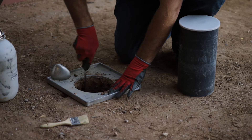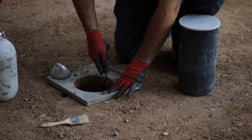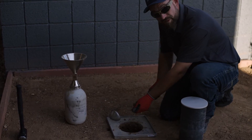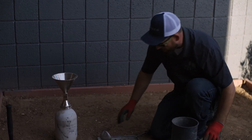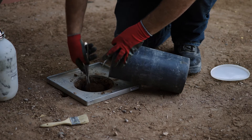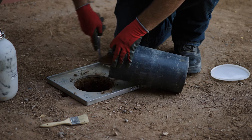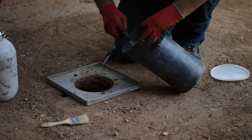We have a pretty consistent, easily diggable material here. Our density from our gauge was at 87 pounds dry density. For this soil, we've worked in it a lot — it's approximately 117 pounds per cubic foot at its maximum density. If I compacted this soil to the highest degree at 100% compaction, we'd have 117 pounds of dry soil in that cubic foot.